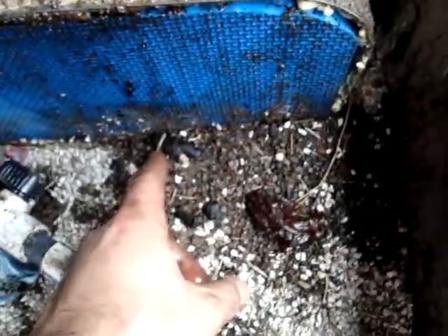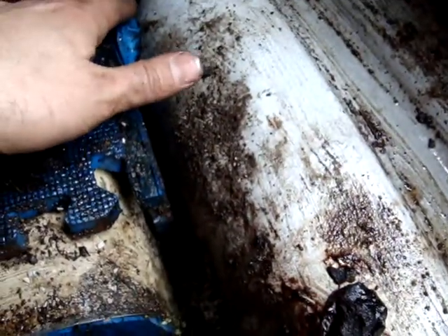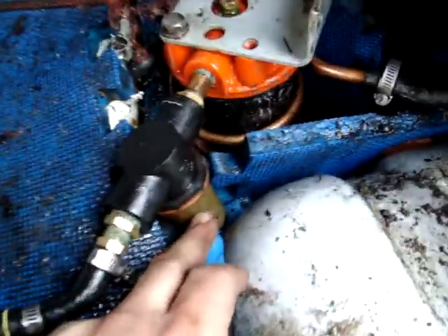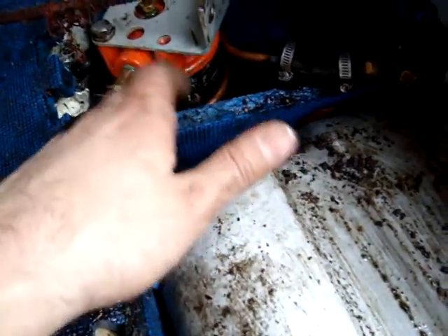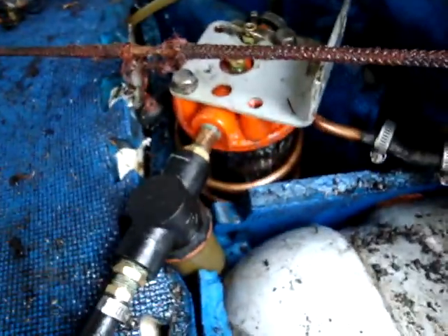Let me give you a quick little demonstration. You see these piles of like turds in here? This is sludge that I'm pulling out of my pre-strainer. I highly recommend a pre-strainer in front of your filter, because otherwise I'd be changing this filter every week. Basically every fuel up, every time I put fuel in it, I clean this little guy out. Unscrew the glass, clean out this crud, and it saves the life of my filter.